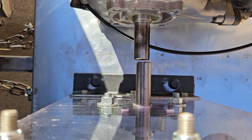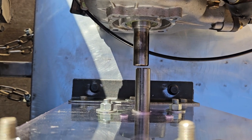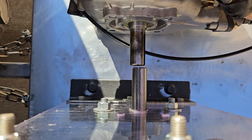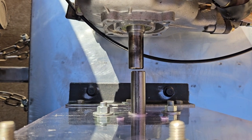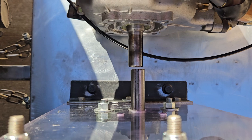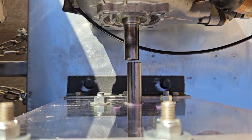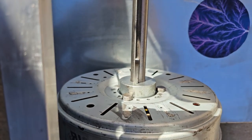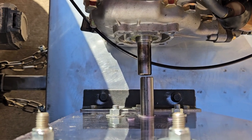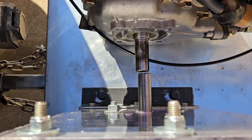I could put a hose on there — I don't think I have a hose that big though. A hose is great as a makeshift coupler if it's all you've got. You can use a three-quarter hose and some clamps, clamp it down, and it'll work. You can even make it so it slips or rips instead of tearing stuff up, which might not be a bad idea.